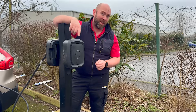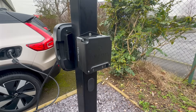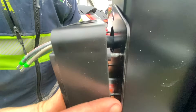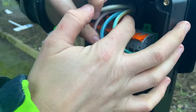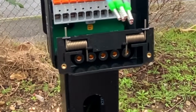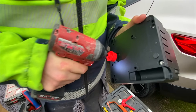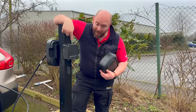The chargers plug into this wall mount unit here. The wall mount is a unit roughly the same size as a 6x6 adaptable box, except inside we have these lever arm termination blocks. We have two connections per termination, so we can loop in and out if needed and daisy chain. At the bottom we have the socket which the charger will plug into once we have the lid on. We have cable entries at the rear, back, and at the top, so we've got plenty of options. You install the wall mount, and that's it.